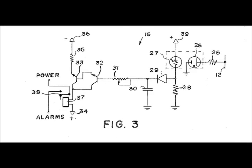In 1978, it was granted patent number 4,220,949 — here's a picture of the main circuit diagram. Here's how it works. An electric fence is not constantly energized. An electric fence throws a very high voltage pulse, as high as 25,000 volts, down the wire for 50 microseconds — that's 0.00005 seconds.